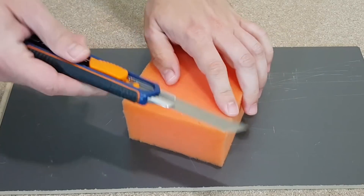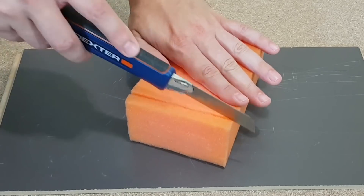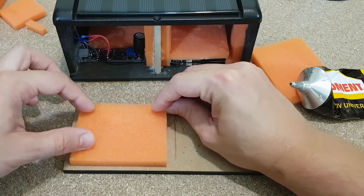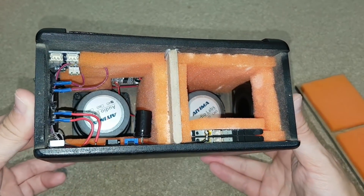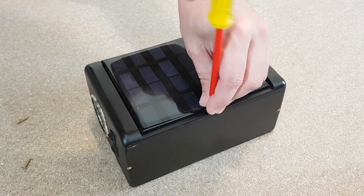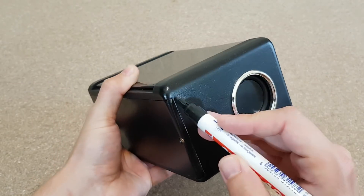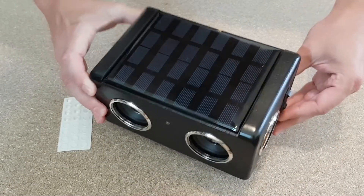The interior is almost finished — I want to add some acoustic insulation. I will make it from this simple sponge; I just need a box cutter with a good blade. I'll cut a few pieces with a thickness of about 8mm. The sponge pieces will be glued to the MDF panels using this universal adhesive — you can also use shoe adhesive. Finally the interior is finished. The back panel also needs to be sealed with wood glue, and I can tighten all the screws now. After the glue dries, you can use a black marker to cover the remaining white glue line.